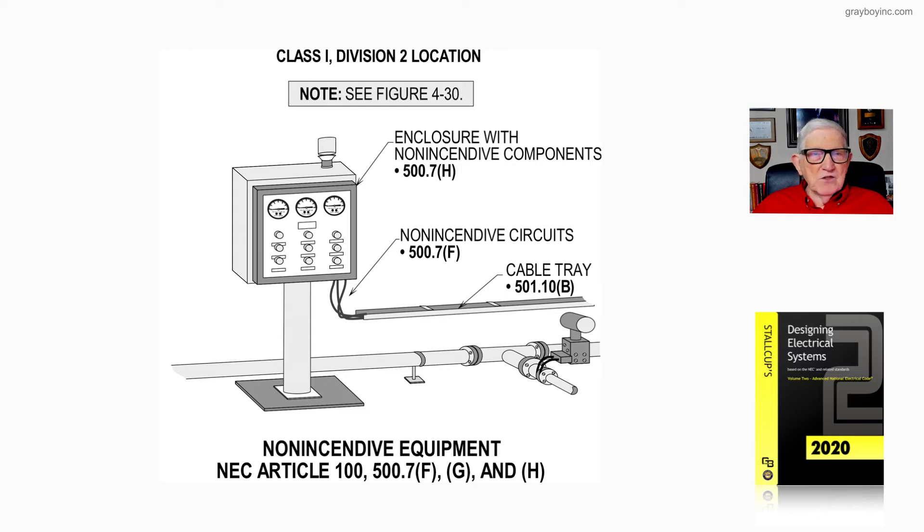You do not need seals. The important thing is that where you're using cables and so forth, you can't damage the wiring in any way — it doesn't have a barrier like intrinsically safe circuits. Damage to the wiring could produce an arc or spark that would be dangerous to an explosive mixture. For example, you couldn't accidentally drive a screwdriver through a device where an arc could develop. That's why it's to be used under normal operating conditions only, never in an abnormal condition.